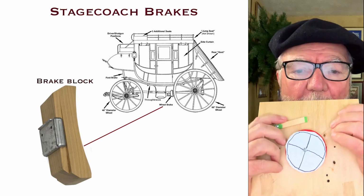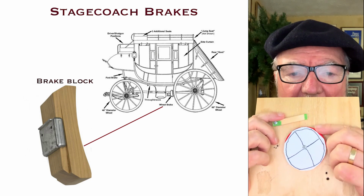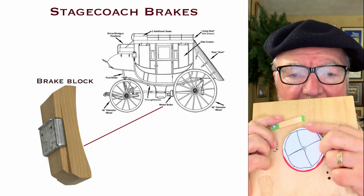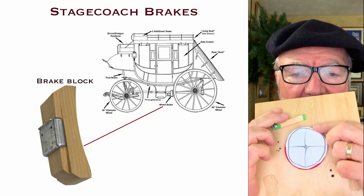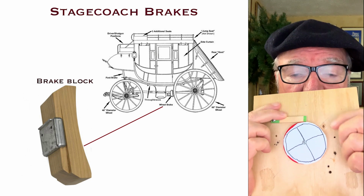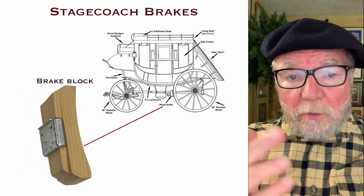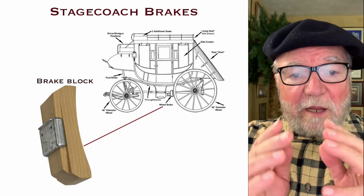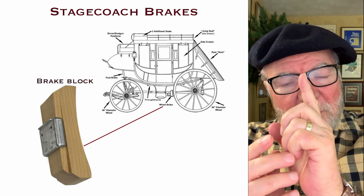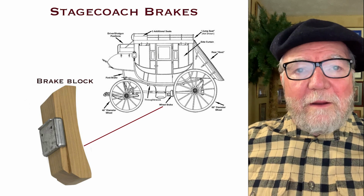Now, the stop second on your watch is very similar. This is your balance wheel, and it's going along, oscillating back and forth. And then when you pull the crown out on a watch that has a stop second, it slams down on your balance wheel, and it stops it. So what you try to do is wait until the second hand comes up here, and then you close it down, you stop it, and then you can work it from there.